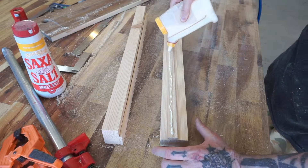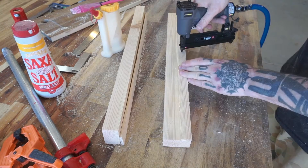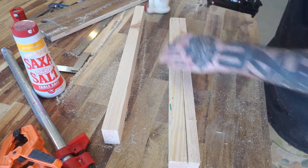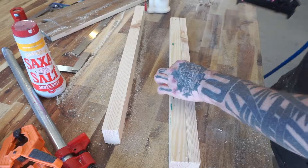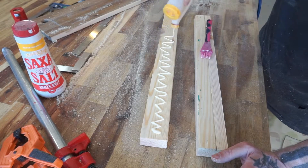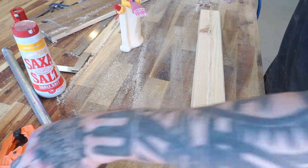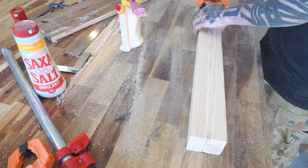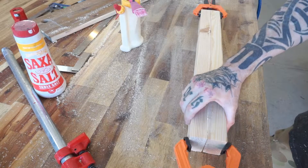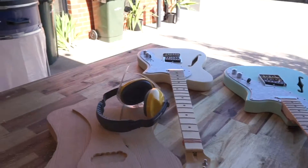I'm laying down glue between each piece, then using the pin nailer to hold them in position while the glue dries. The pieces I'm working on right now are the middle strips, and they're getting pin nailed too. The last part of the spacer block is too thick to pin nail, so once the glue is applied and spread evenly, I apply some cheap clamps to hold it together. These pieces actually have a bow in them and the middles of those bows are facing each other, so this job really only needs a clamp at each end. I used ten anyway.